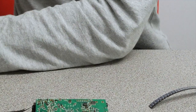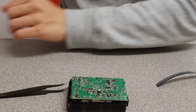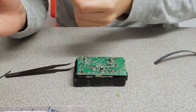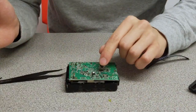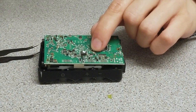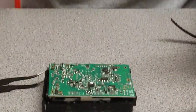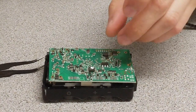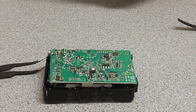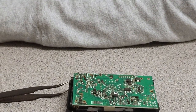The problem is, as I've mentioned beforehand, this is a relatively beginner to intermediate soldering project which is SMD. To put it in comparison — this is my finger — so you're dealing with really small surface mount resistors. What you would ideally want to do is use one of those clip-like soldering irons where you can clip both sides and take it out. But as this is beginner to intermediate, you pretty much have a single soldering iron, so make well use of it.